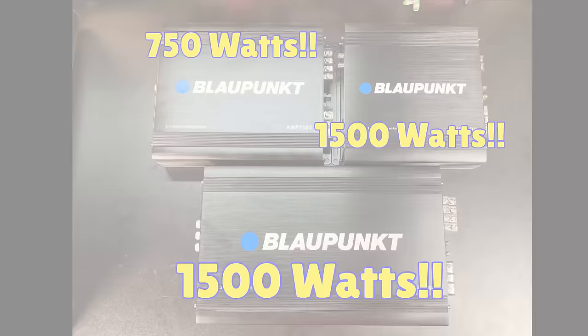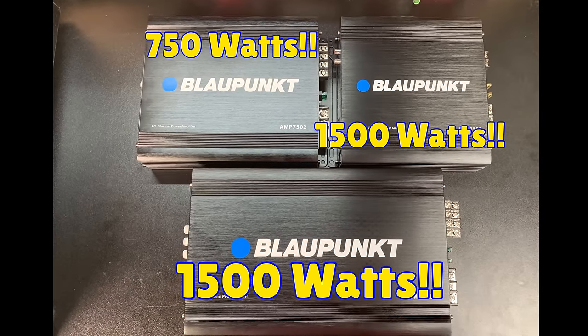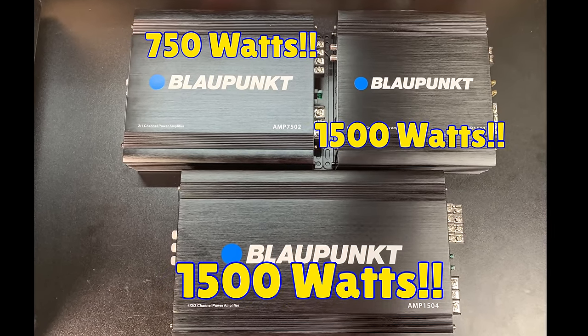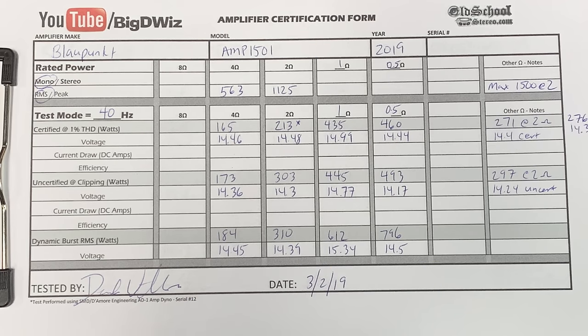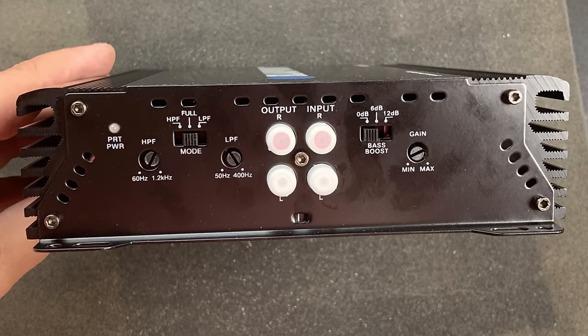Now, the thing I really hate about these is the numbers they put on the box. 750 watts, 1500 watts, 1500 watts. Well, the monoblock we've already tested, you notice at the most we got 800 watts, and that was a dynamic burst at half an ohm. But yeah, these amps just don't do anywhere near what they're rated.